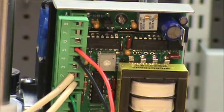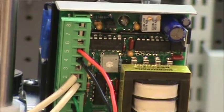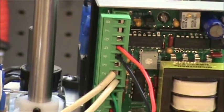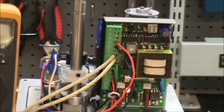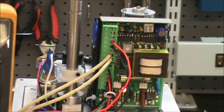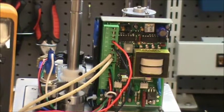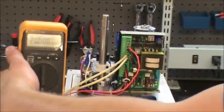The span controls the open position, so you're going to give it a 20 milliamp signal. You'll notice the red LED light down here is on — that light will stay on as long as it's traveling. If the actuator stops operating and that light is still lit, that means you've reached the factory set travel limits, and you're going to want to turn it counter-clockwise.